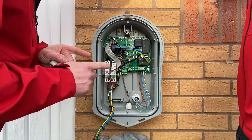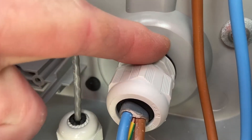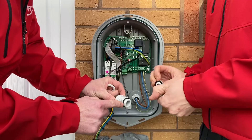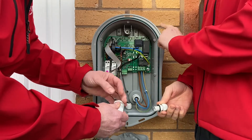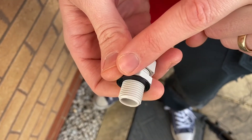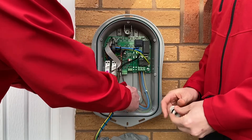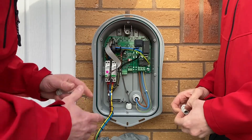There is one other key element: in both cases there must be an O-ring or seal present, whether on the inside or the outside. As you can see, you've got your seal there - without that the gland doesn't have an IP rating. In this case it's IP68, but we've got to at least match the IP65 of the fitting. If you don't have that O-ring on there, you lose the IP rating of the gland entirely. Simple solution to what could be a major problem - if the cable just came through flooded with silicone, with all these electronic components inside, ingress of moisture would do several hundred pounds of electronics no favours whatsoever.